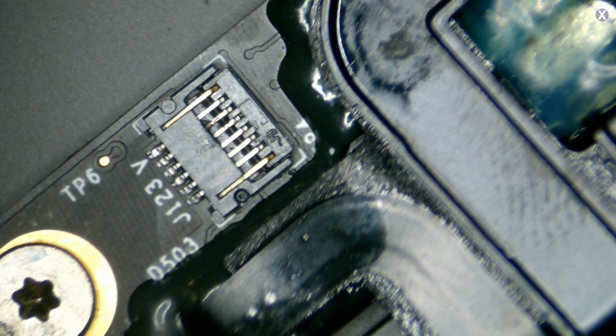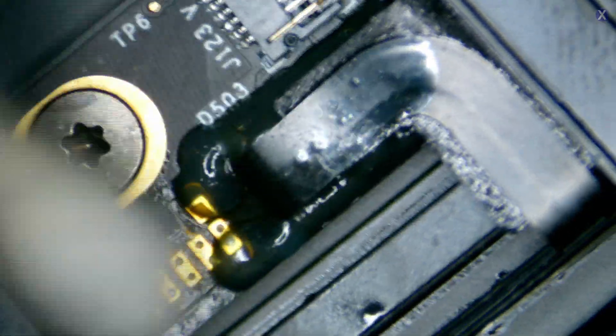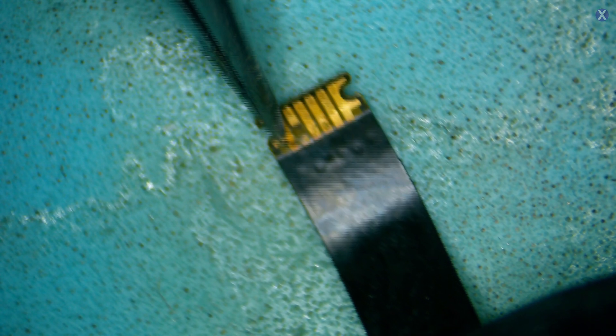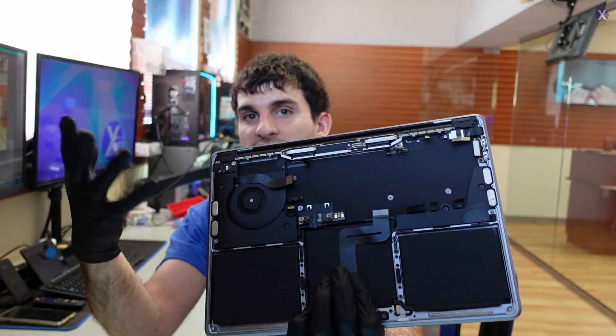There's a little bit up here — this is actually a little bit burned. We can't really scrape this off because it's already scraped off. This cable is very important — it connects the battery to the logic board. On MacBooks, even a speck of dust blocking that connection can cause loud fan noise, battery not detected, or many different errors, because MacBooks need the battery connected. The later ones have a little board that communicates the battery to the main logic board. If there is a burn on it, that's a very important connection because that's what's communicating between the two.